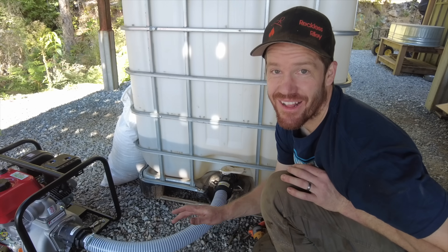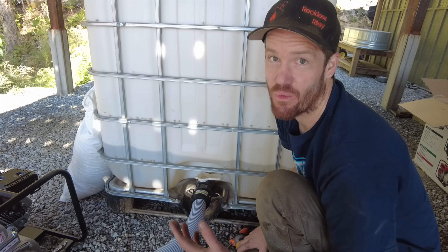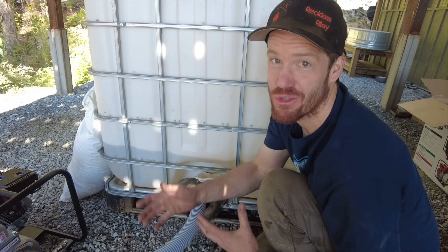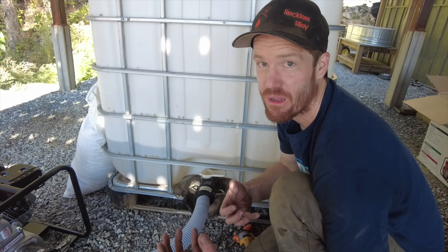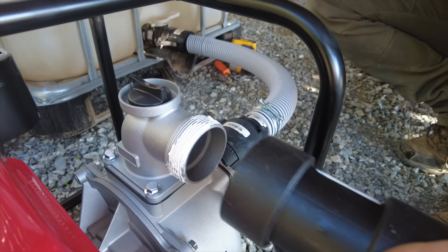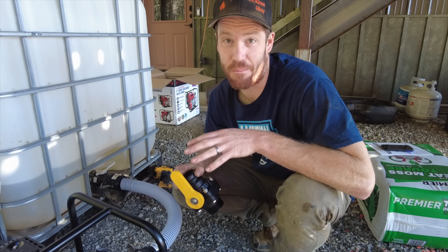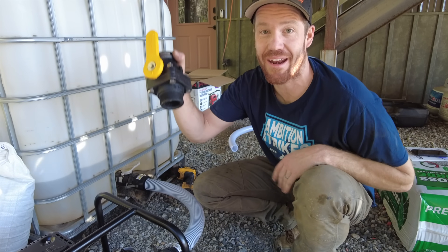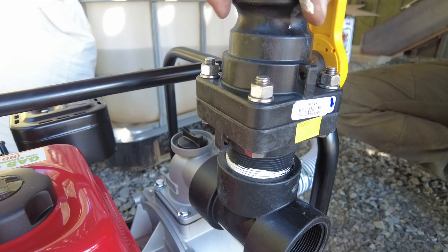With our suction side of the pump done, it's time to do the outlet side. There's actually going to be two outlets. The first one is a jet — that's going to recirculate our mixture from the pump back into the tank and help agitate our solution to keep all of our seeds suspended in the water. The second one is going to be the actual spray nozzle that we spray our seed out of. This pump has a fixed output, and we need to adjust how much goes to our jet versus our spray, so we're adding a valve on the jet side to throttle it up or down.